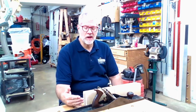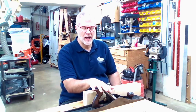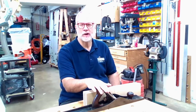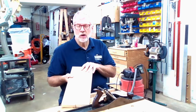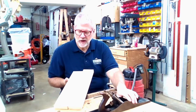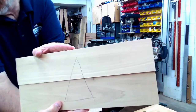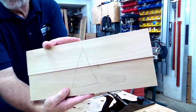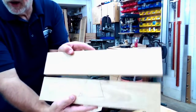In my shop I use a mix of hand tools and power tools — usually using power tools for rough dimensioning, a planer and jointer to get my boards where I want them. I don't do a lot of hand planing for sheer rough dimensioning, but I do use a lot of hand planes near the end of a project. One of my most common uses of my joiner plane: imagine I'm doing a panel glue-up. I want my pieces of wood to match up exactly perfectly as I get ready to glue and clamp them. I have my cabinetmaker's triangle on the boards to show the order — especially important for several boards in a glue-up.